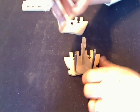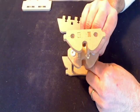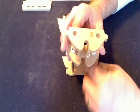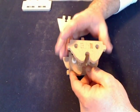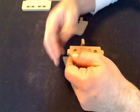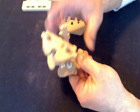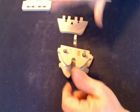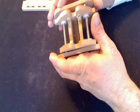Slide the A assembly back on — make sure your tabs are to the top. Make sure you put your finger on the plastic piece so it doesn't pop out, and you've got to kind of work them on at the same time. Also keep an eye back here — I'm noticing that D1 tilts in a little bit and was blocking me from doing that. Okay, that looks good. We'll take C1, place it back on top — the screws should hold everything together. I'm just going to press fit these holes back on here and squeeze everything gently together.